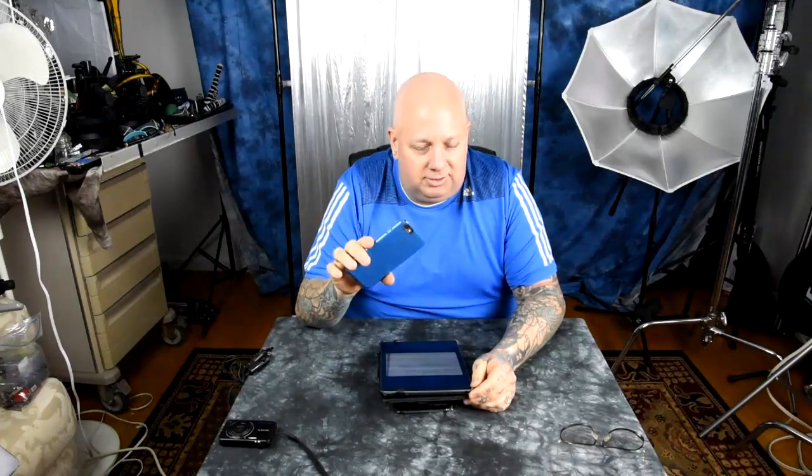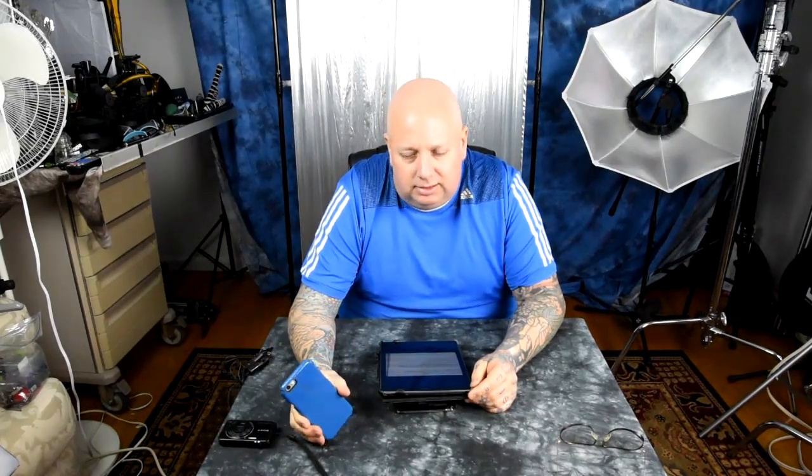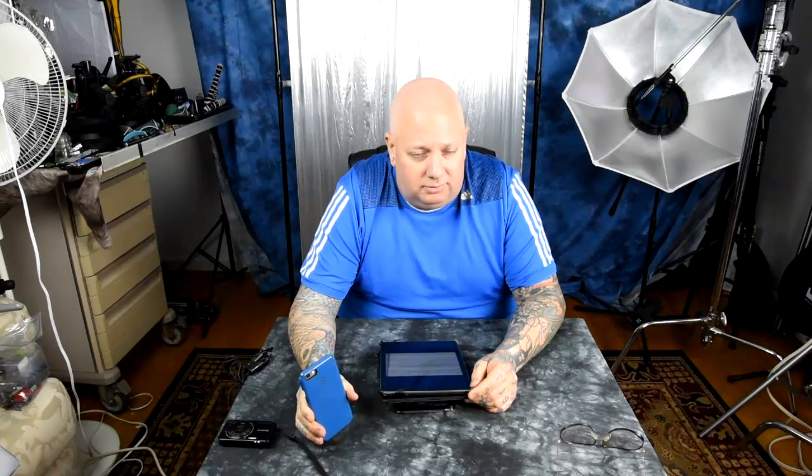You won't hear anybody talking about it, but what the cell phone demonstrated is the issues that exist inside the Sony a7 and every DSLR really. When they get hot, they have hot pixels. People will say, 'Oh my god, my camera is a 40-something megapixel camera.' But it is not ISO-related noise, it is not sensor-based noise — it is EMI-based noise: electromagnetic interference. Certain cameras are far worse than others, but I'm saying all of them have it, so I'm not singling out Sony.